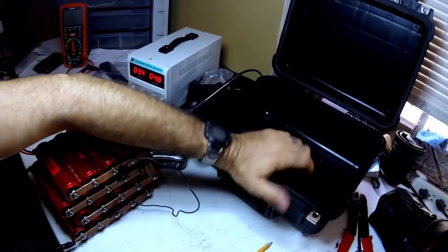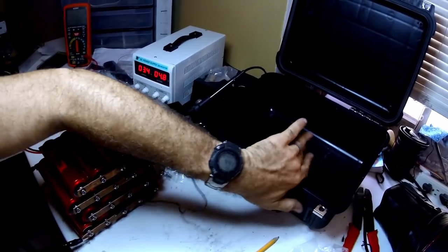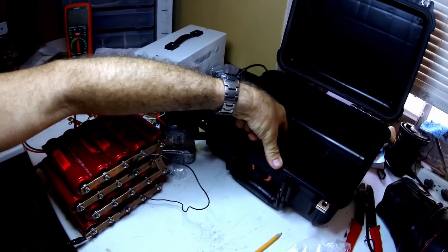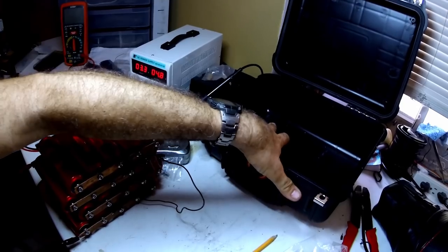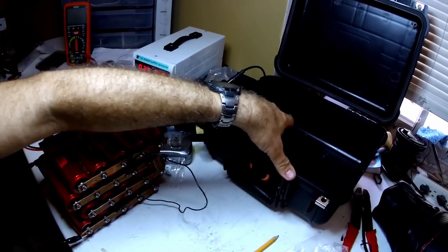If you turn one on, the circuit breaker will trip if it gets more than 20 amps. And that'll be for her little outboard motor. But the other circuit breaker will be for 100 amps or so. And when that's on, it's like 100 amp maximum battery, just because I really didn't make the buses big enough for anything more.